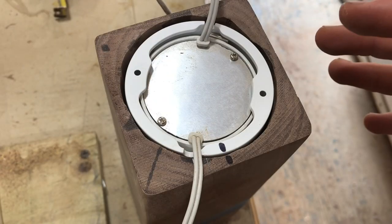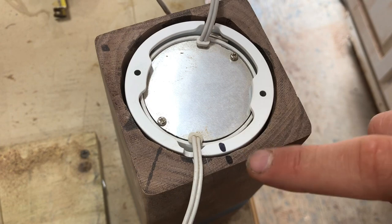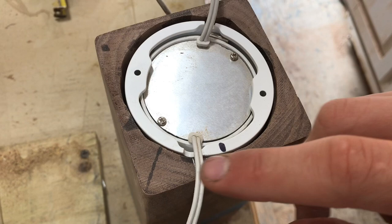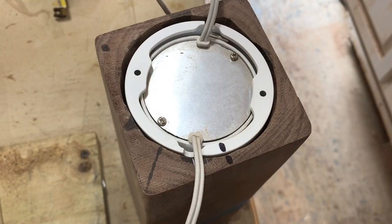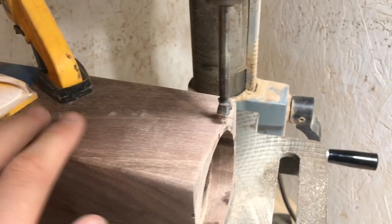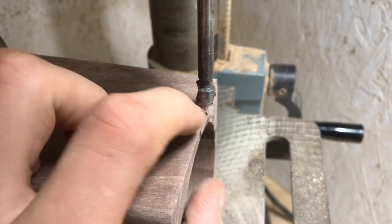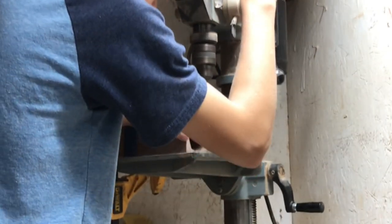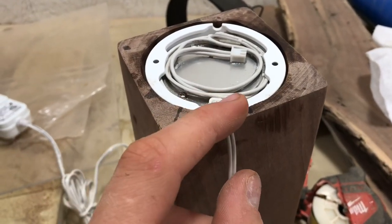I just gave it a quick little sanding. Now we need to start working on the base. I made a little mark on our light and on our wood so I can put the light in the same position every time. I've also used a pencil and made two little marks where I want the cord to go through, so now we just have to cut a little slot so the cord can escape. I've got our light clamped on the drill press so we can use a Forstner bit to drill a little half-hole right at the bottom. Now our cord can safely come out the side.